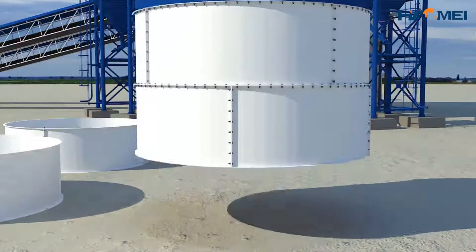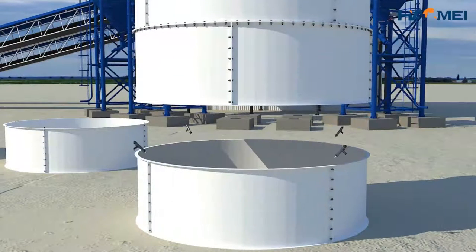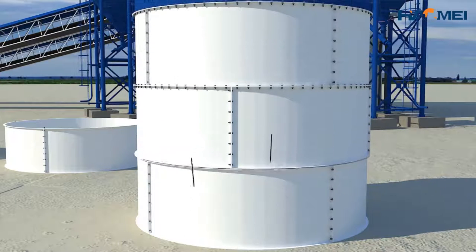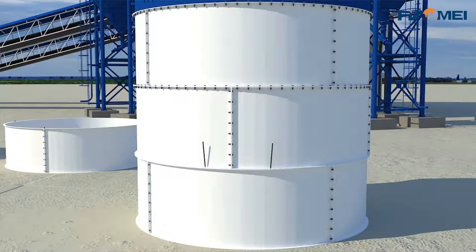The cross connection method is applicable for the 3rd, 4th, 5th, and 6th sections as well as the upper cone. The installation joints of the storehouse body shall also be filled with sponge and sealant, and then bolted tightly.